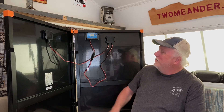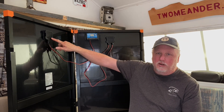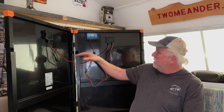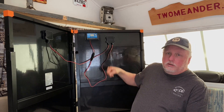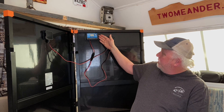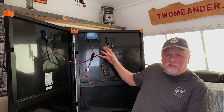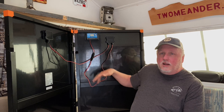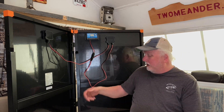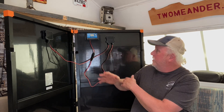This is the back of the panel. These are the control boxes — every solar panel has a box like this where the circuitry lives and the wires come out. On portable solar panels, you'll generally have either a solar charge controller — this one has a PWM 20-amp controller — or a box with USB plugs and a connection just for a portable power station. I don't think I've ever seen a portable panel with an MPPT controller.